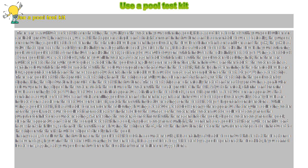Step 3. Using test tubes or similar apparatus. Similar to the test block, some kits provide a test tube or an apparatus that contains a couple of test tubes and vials for filling pool water, and different reagents are introduced to test pool water quality. Safety levels are indicated on a scale on the test tube or beside it. Match them with indicative readings on the test kit.